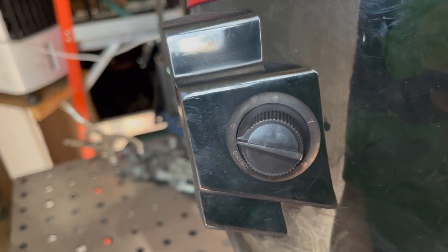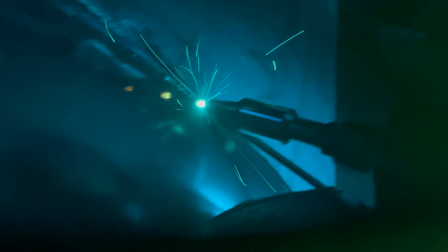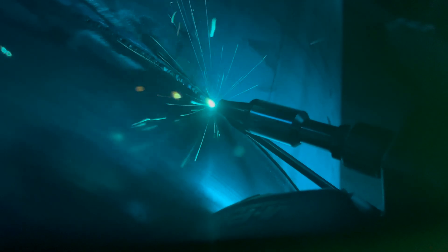I would highly recommend buying one of these welding helmets that's meant for laser welding. The laser safety glasses are only there to protect against laser light reflection back into your retinas. The laser welding helmet has that laser light protection but also has a normal welding shield at around a shade 5 to 9. That lighter shade lets you actually see the weld pool, which helps tremendously — you're welding blind without it. A normal welding shield won't work because it doesn't have protection from the laser light.